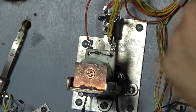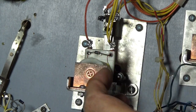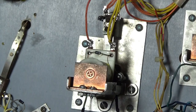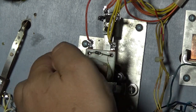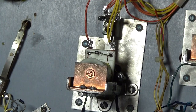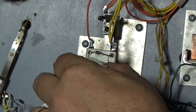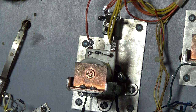So it's a little bit like you've got a tap, where the hose is full of water, which is your positive lead, and then suddenly you complete the circuit by releasing the sprinkler head on the other side. It's effectively completing the circuit, allowing the current to flow through and to go somewhere. Now, what that means is you can test your solenoids by simply completing that circuit manually by grounding the negative lead.